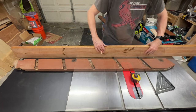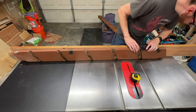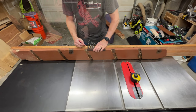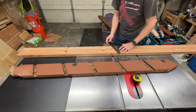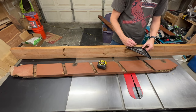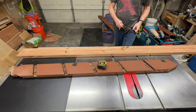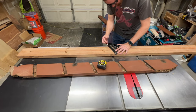Then I'll trace the top angles. Next I'll transfer the location of the top of each stair. I'm going to do the top only because the new stairs will be 2x6 material which is thicker than the old ones. Now I'll mark the angle, which is 22.5 degrees, using my speed square. Next I'll offset down from those marks by an inch and a half and then mark the angle for the bottom of each step, again at 22.5 degrees.